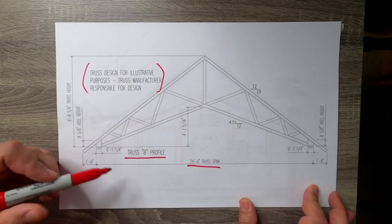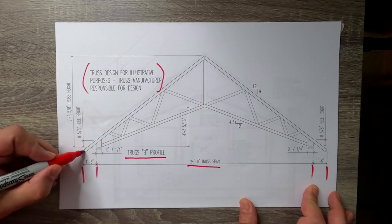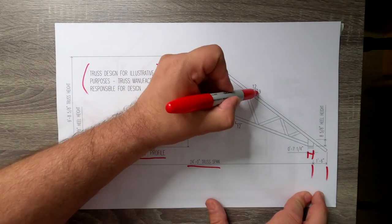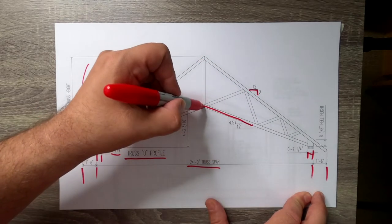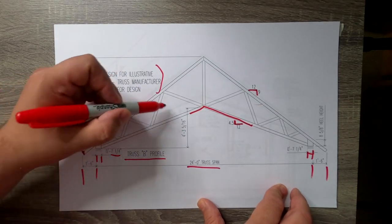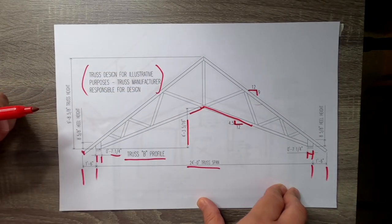So what are those intentional dimensions? We know it's a 24-foot span out to out. We knew our overhangs were 18 inches, our bearing was seven and a quarter inch on each side with a two-by-eight wall. We also knew the rise and run of our top chord was nine and twelve, and the rise and run of our lower chord was four and a half and twelve. So I drew up the outlines basically illustrated to say this is a truss, and gave those dimensions — from top of plate to top of ridge, four feet three and five-sixteenths; height of the truss, nine feet eight and five-eighths. And then here's that little detail: the heel height — eight and five-eighths inches.